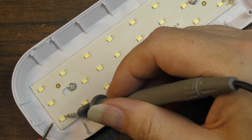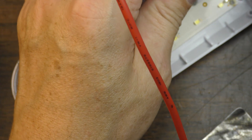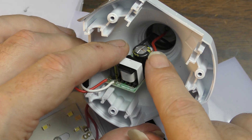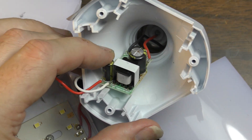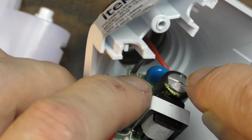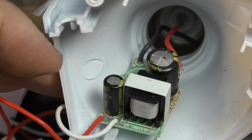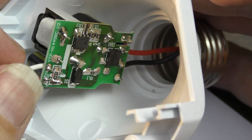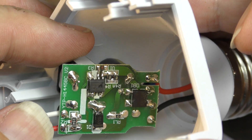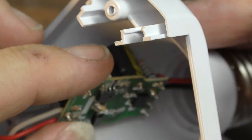And the final three — wow, okay, so all those are good. So maybe I'm missing something. What I'm noticing right off is that we have a bad capacitor on this board right here. You can see that it is bulged out on the top. There are some score lines and those are split, actually even in the middle — this is a blown capacitor. We need to change that. I'm not surprised to see a blown capacitor; it's pretty common. I just wonder if when the capacitor blew, it took out something else in the process. Let's change that capacitor and then assess further.